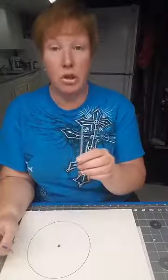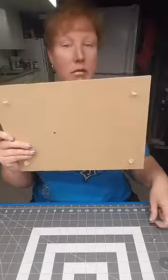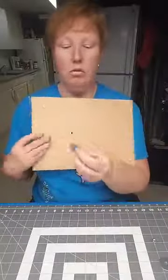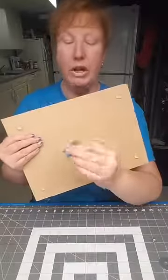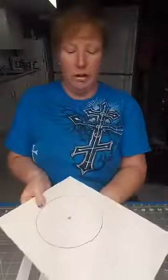But for this one, you can do all kinds of things with this system, just adjusting the lengths, the diameter of the threaded rod, all that kind of stuff. So let's get busy here. We're going to put the bolt, oh, not yet. Have to have a washer. This gives it stability. You do not want it chewing away at this. So we're going to put the bolt through the fender washer. And that's a 1/4-inch fender washer, and the 1/4-inch is denoting the hole in the washer. Okay. And you want it to be snug like this so that there's no wiggle.